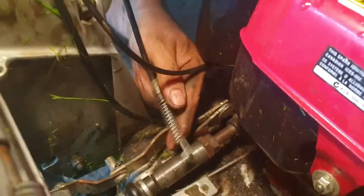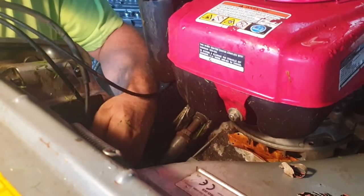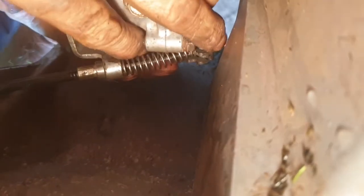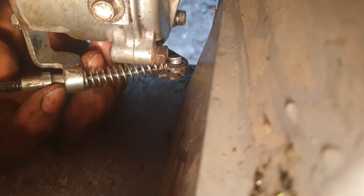And then we're going to put the drive cable back on — makes it all happen, just goes forwards. There's a little slit in the top which the wire goes into, so you have to come in from the back side. Make sure the wire goes in the slot and then down. Then you have to get the spring to sit properly — there's two prongs it sits in. You pull it this way to take it off and slide it back in the other way.